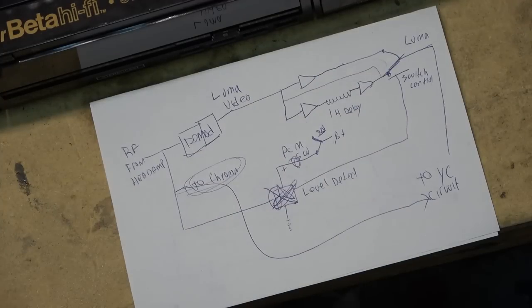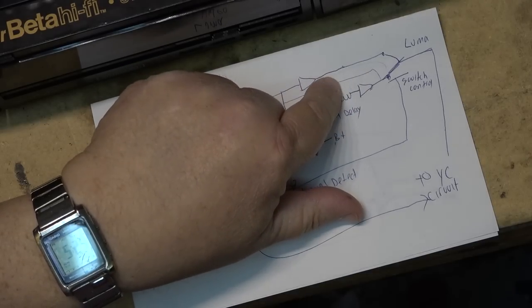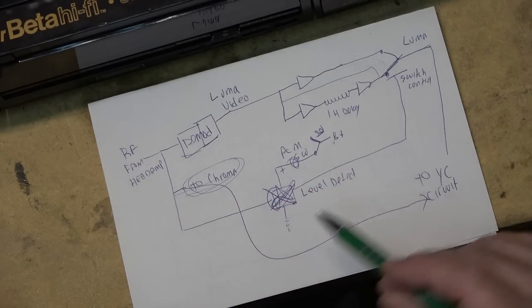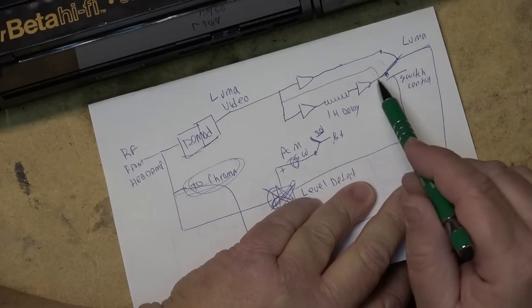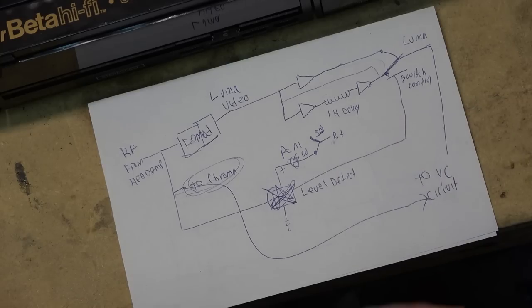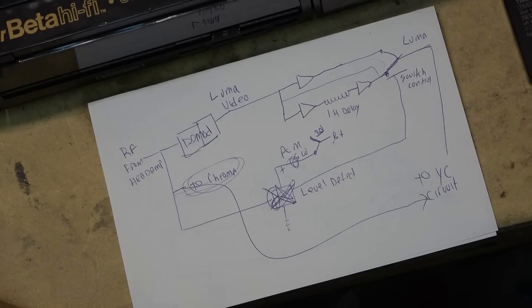When using the machine as a digital audio recorder, you can't have this repeated line of information — it will cause errors and make your digital signal unrecoverable. When recording digital there's error correcting data included in the digital payload that will compensate for any errors or loss of signal. With video, you don't want to see those white streaks, so you use the dropout compensator. As I showed, when the dropout compensator is on it can cause disruptions on digital TVs due to signal processing. Sometimes turning off the dropout compensator gives an improved picture on a flat panel, but on a CRT the opposite is true.